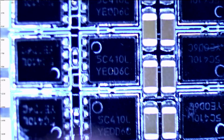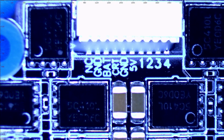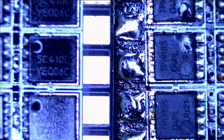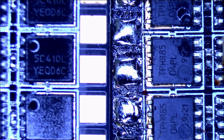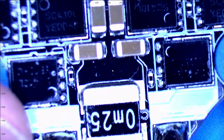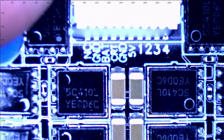Alright pilots, now that we're in the scope, the first thing I want to do is check our pinout. We've got NC — no connection — ground, battery, current, ground, five volts, and one through four for our ESC connection. I'm going to slide in the old ESC, and what do you know — no connection, ground, battery, current, ground, five volts, one through four. I wanted to confirm that if something happened with your old one, you could unplug and plug in the new one — and it's true. Comparing the MOSFETs side by side, the new ones are definitely bigger and more robust. These are actually high-performance MOSFETs imported from Japan. The ceramic capacitors are also present — plenty of filtration there. You are completely laced with FETs all the way around, and we have those big, beautiful solder pads.